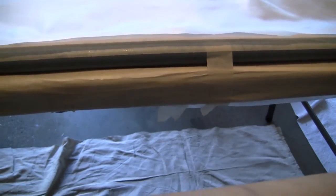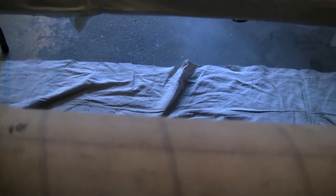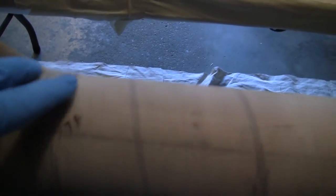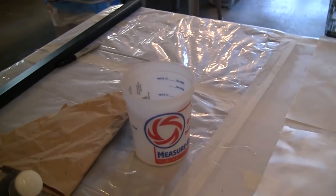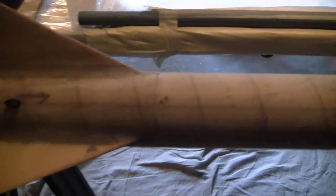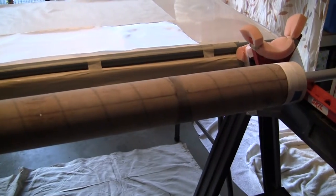I'm going to start the fiberglass offset from the original starting line on the six-ounce section, overlapping by a half inch. This time I'm going to use only one Teflon wrap instead of two. Last time I did the tubes I did two wraps but there were some air bubbles where the two Teflon sheets appeared to have separated. So I've got the one sheet of three-ounce fiberglass cut, the Teflon sheet, and the adhesive mixed.